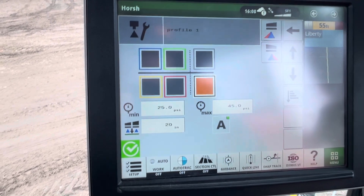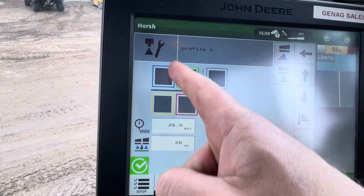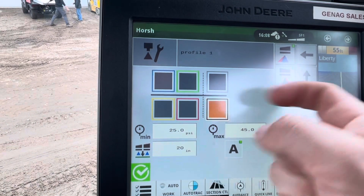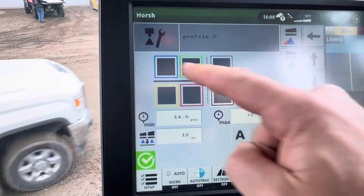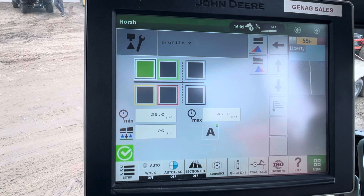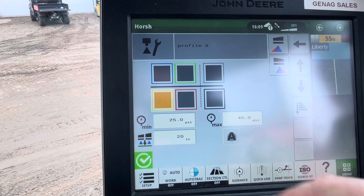Next we'll set up profile two — the next biggest size is a green, which is a 1.5 size. While we're here, if we're on just the two position turned on by itself — that's 150 feet — we need to make sure if this side is on by itself we turn these on to give a full 150 feet. Next, that green tip: turn it to auto, change boom height to 20. Profile three will be an O2 yellow — change boom height to 20, automatic.